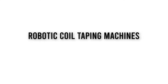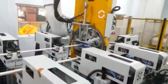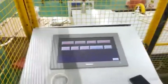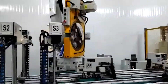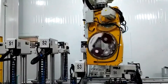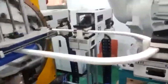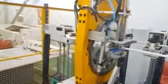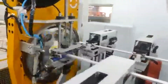The robotic coil taping machine features a state-of-the-art high-end technology solution with an electric taping head. It can tape a variety of coils with lengths up to 3000 mm and spans from 200 mm to 1000 mm. The robot is a fully articulated six-axis robot with an additional axis for the taping head and a payload of 200 kg. The taping head can tape both straight and involute wind diamond portions, as well as the knuckle and nose portions.